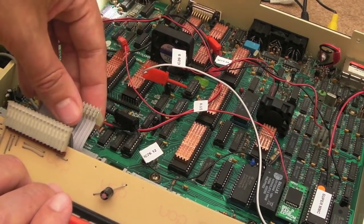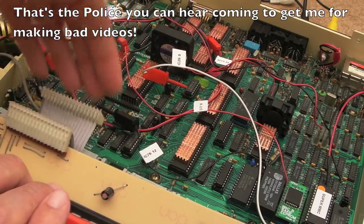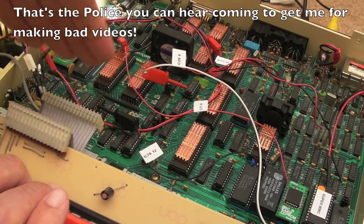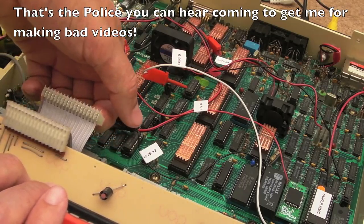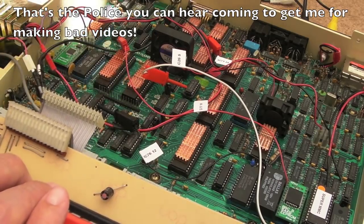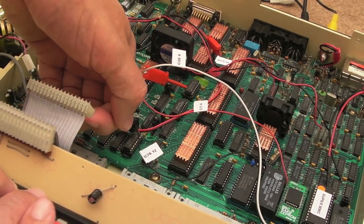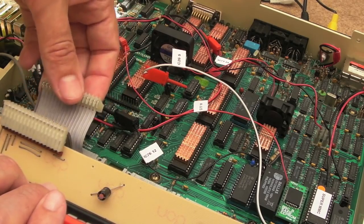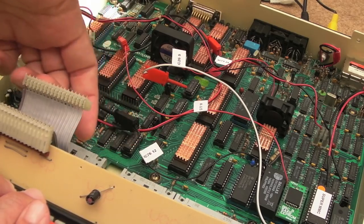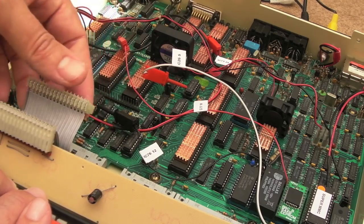And there's an argument to say, depending on which way this is bent, if those have been bent, you can have a good or a bad connection if there's some torque there. If the pins just fit straight into that slot like that with no movement, no torque, no pressure from one side or the other, it's fine. But if your slots are loose and the pins are a bit misaligned, you're not going to get a good connection. And I have had a bit of that, which is why I've had to straighten them and stuff.